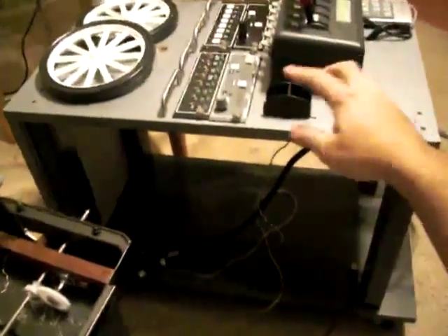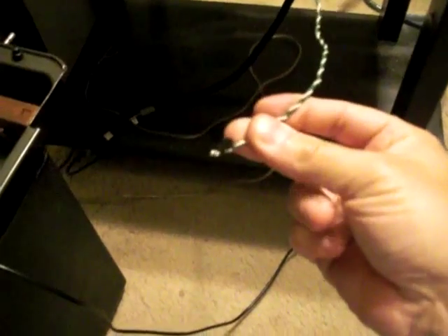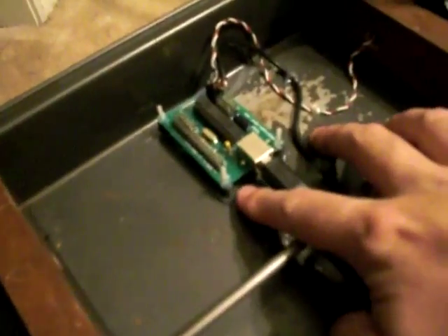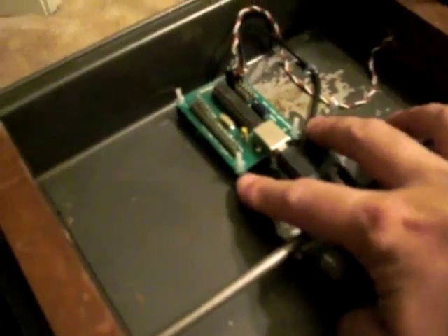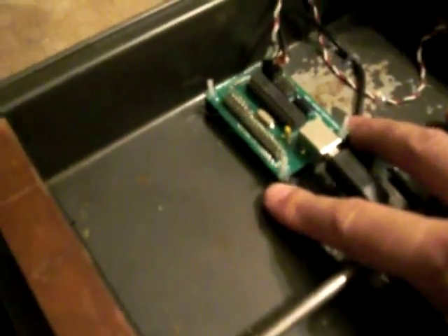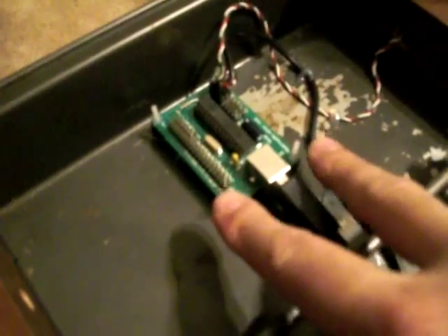As you can see, we've got our flap switch mounted and its wire is all soldered and ready to go on the Desktop Aviator 2090 board, which is sitting right there. I mounted that on some little nylon posts and hot glued it in. I used some of those rubber grommets to elevate it — you want your little project board to sit up a good half inch off the metal so the metal underneath doesn't make contact with the board itself.